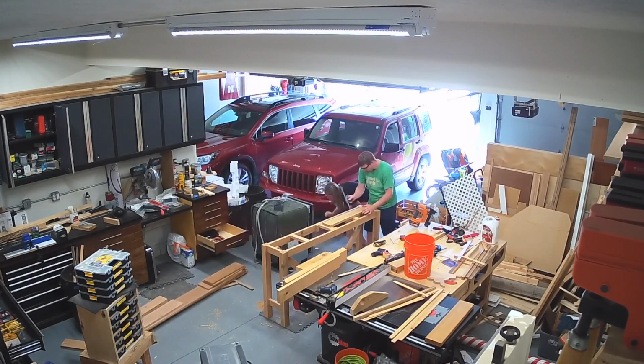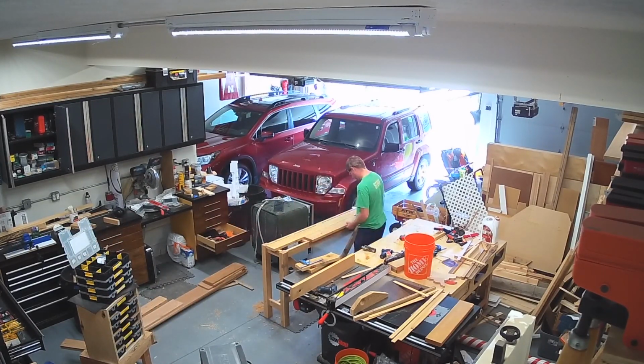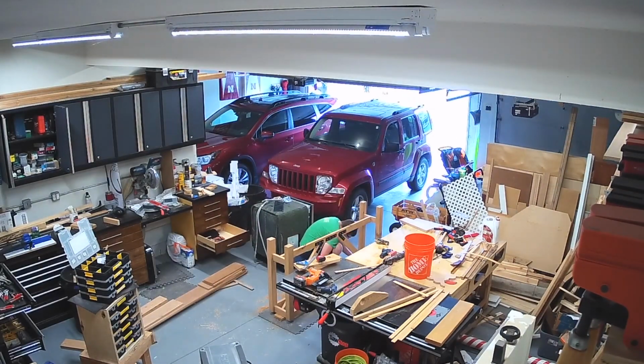I lined up the top planks starting in the middle and used a few brad nails from the bottom just to hold things in place. After that, I attached everything with some screws. I probably should have drilled pocket holes in the skirt boards to attach everything, but I didn't and just toenailed in some screws where I could.